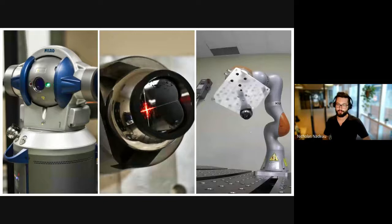Beyond machine learning applications, I've really enjoyed using this technique of hardware in the loop for even just calibrating robots. Using gRPC and the hardware, in a variety of applications with Faro laser trackers, we're able to just have the robot automatically dance through its workspace and create a point cloud for basic accuracy calibration.